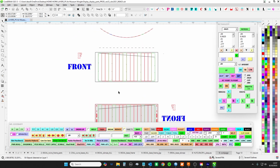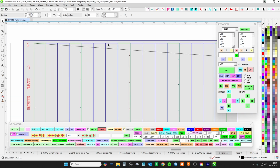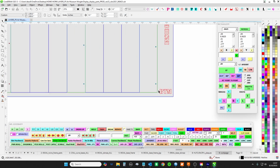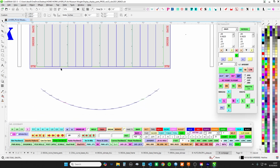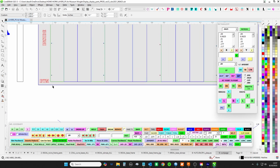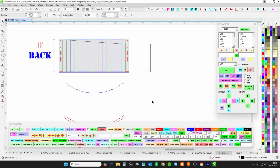But you're going to do the front and the back. And then these Cleco holes, the center one should line up, because I gave you so much to work with, you don't have to worry about it. But if you line up the center ones and use solid Clecos there, that gets the party started. And then I gave you long ends a little bit just to reference. Hopefully it works out. But if you keep this square to the rollers, perpendicular, you should get a nice even curve, and it should give you 1 inch from the bottom, and 1 inch from the highest point.